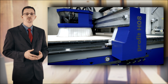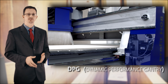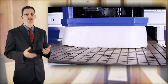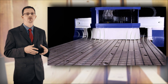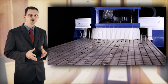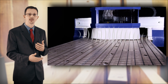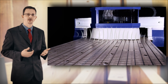The Profit HO8 has a dynamic performance gantry system. This importantly means that the rack and pinion drive for the gantry has two drive motors on either side. These two motors talk to each other, making sure the gantry is driven on both sides and are synchronized to ensure movement is perfectly accurate and stable. Machines with single-sided drive systems tend to have more tolerance issues later down the line, as the gantry drive is literally pulling on the other side.